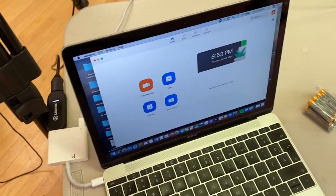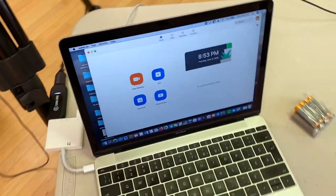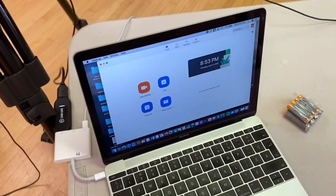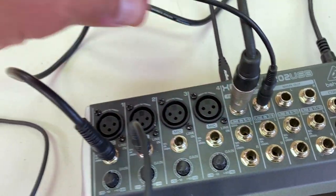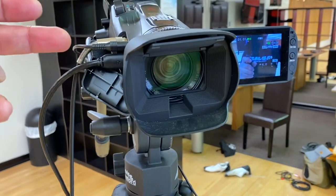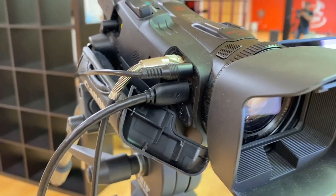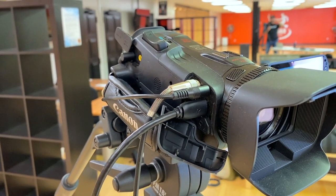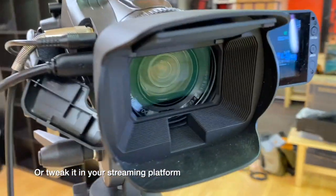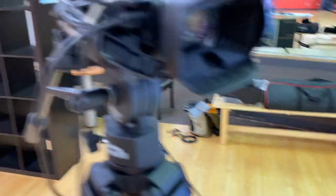Now here's one thing. I tried it once using the USB signal on another USB port and the sound wasn't synced with the image — and that's a problem. So what I did was output the sound from the mixer's line output and plugged it directly into the camera's mic input. But you have to be careful because when you plug a line out into a mic input, the signal comes in very hot, so you have to calibrate. It's always better to record a bit lower so that in post you can tweak it. You don't want the levels to clip — you have to be careful with that. The sound coming out of a mixer you have to put fairly low.